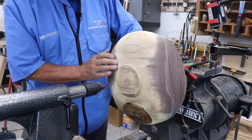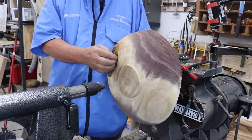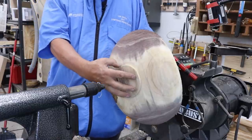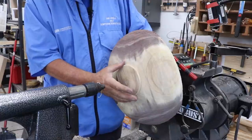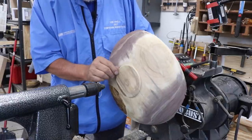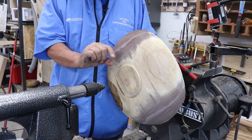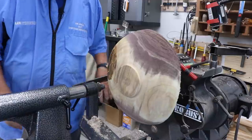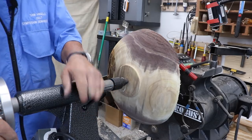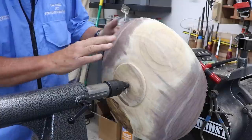Here's a closer view of the underside of my bowl. You can see some really badly torn grain right here. There's some bark that needs to be taken away. Ordinarily I would do an expansion recess right here, but I wanted to mess around with a compression fitting and maybe put a little bit of a foot on this, which I don't usually do — but let's try it. Eventually I can take this tenon down about halfway so it's not quite so thick. I'm going to continue with my tail center for support and then we'll reverse this.